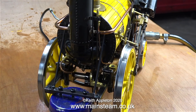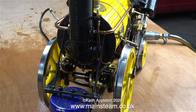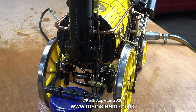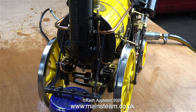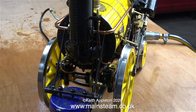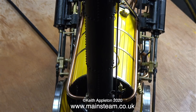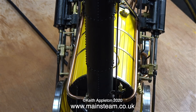The original Stephenson's Rocket, as far as I'm aware, used some valve gear called gab valve gear - similarly to the old beam engines, this type of valve gear allowed it to be moved by hand. But the levers fitted to the valve gear on this model are for decoration purposes only. The valve gear fitted to this engine uses two eccentrics and it's called slip eccentric. A lever that you press on the footplate selects either one eccentric or the other, and once the eccentric has been selected you have to roll the engine forward or reverse depending which way you want to go.